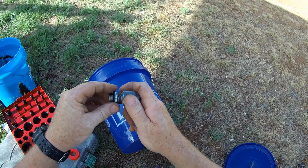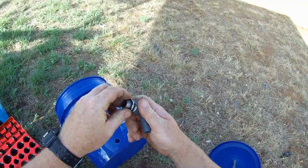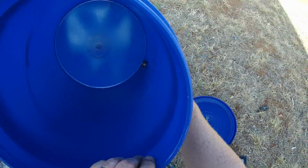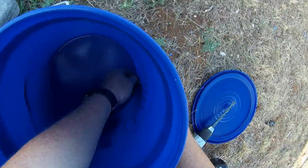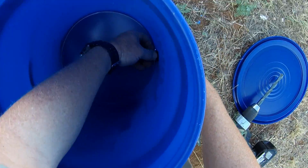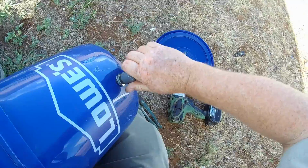Okay, so you see how that is right there. Now, we're going to put that on there. You see down there, this is barely sticking on the inside? Go ahead and grab another one of these seals over here. Put it on there, and then another 1/2-inch EMT nut, electrical metal conduit nut, and we're just going to tighten this sucker up right like this.